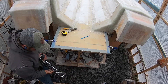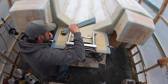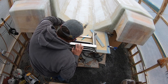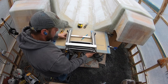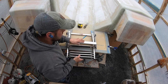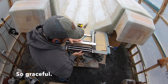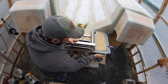The swim ladder we wanted actually mounts under the deck, kind of like so. These pieces should kind of pull it up and level and give it a little bit more support from underneath here, and that'll all get glassed into place. The whole idea is that the ladder is just kind of out of the way, and if you're in the water, you can easily deploy the ladder down to get back into the boat, and it folds up really easy.